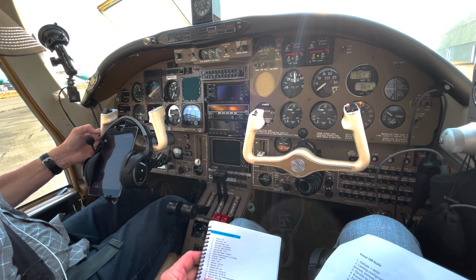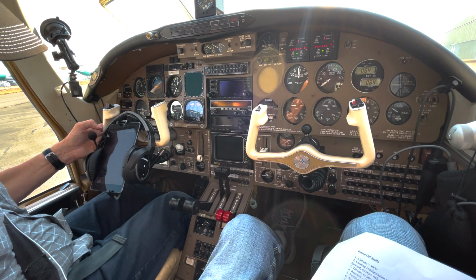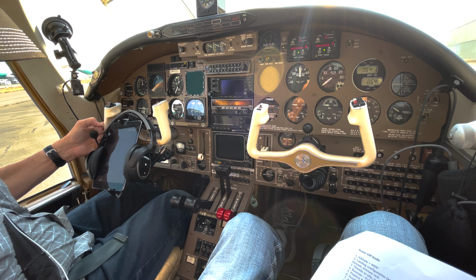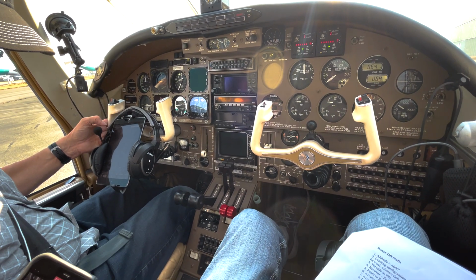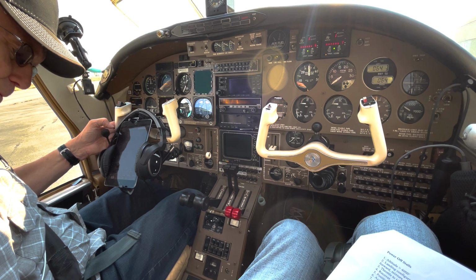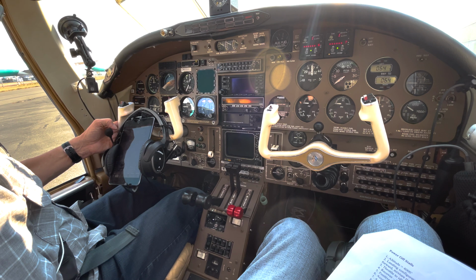Okay. Down here, pressurization is set at 2,000 feet. We're about 600 feet here, so that works fine. Come down here, alternate air, bleed air's on both of them. Door seal's deflated, and we're in the normal dump mode. And I've got the alternate air doors, which are part of the anti-ice certification, are free, and they will open when I do that and pull them.